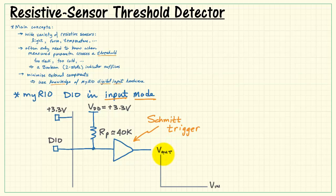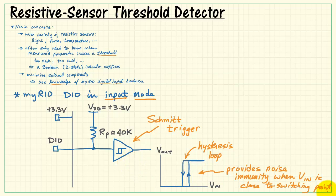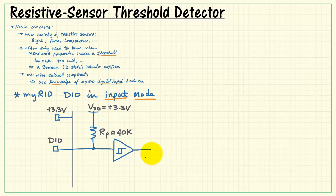Let's take a look at the voltage input-output characteristic for this Schmitt trigger. I'm plotting the input voltage and the output voltage. As the input voltage sweeps back and forth, the output voltage is in either one state or the other. On the way up, as VN goes from zero to some maximum value, there's an abrupt point at which Vout switches from low to high. But when you come back in the other direction, that switching point is at a different location — a little bit lower. This deliberate spacing between those two switching voltages is called a hysteresis loop, and it forms the basis for the symbol for the Schmitt trigger device. The hysteresis loop provides a great deal of noise immunity when the input voltage is close to that threshold switching voltage.